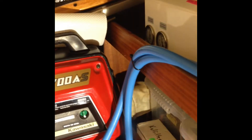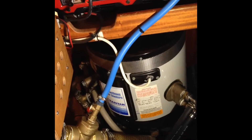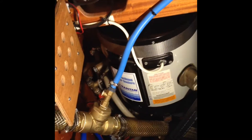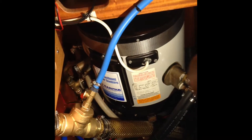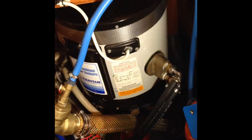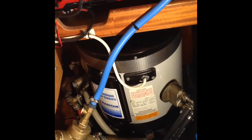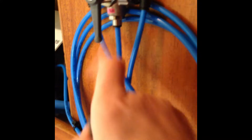You can see the reject — the brine reject line. We've chosen to connect it the shortest way, which is the self-draining bilge from the cockpit. We've also put on a reverse flow valve — this little component — just to make sure no water comes back up the line, since the waterline runs basically right here. Just in case, we don't want any more water up there. And then the production line comes through here.